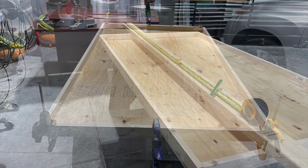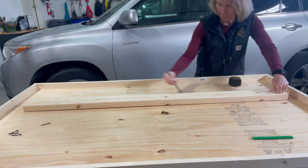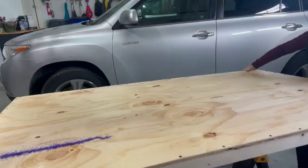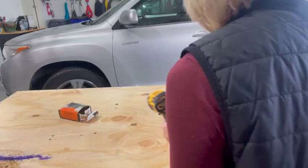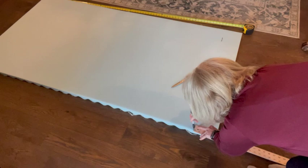Once all four boards were glued and screwed, I took a 2 by 4 and measured it approximately 60 inches in width. I evenly placed it onto the headboard one third of the way down. I attached it with shallow screws approximately 2 inches so it would hold while I flipped the board, then attached longer, stronger screws from the top end. That's what will hold the French cleat which holds the headboard to the wall.